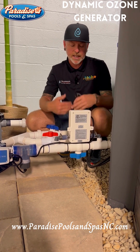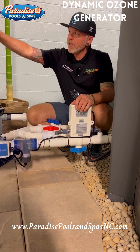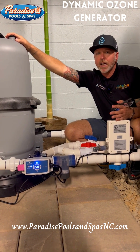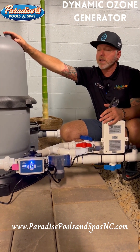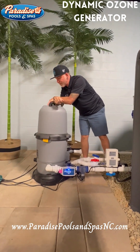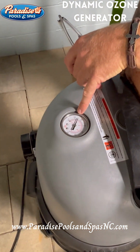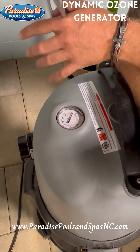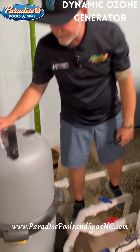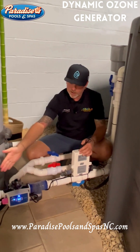The directions are written on the side I'm facing, but I want to make a YouTube video to help everybody out. With a brand new or clean filter — and by clean I mean no scaling inside the filter pleats, because scaling will make it run slower — you should see only 10 to 15 pounds of pressure on top of your filter gauge. I tell people just start with a brand new filter at the beginning of the year so there's no guesswork. Once you confirm that clean filter at 10 to 15 PSI, turn the pump on and let the water start flowing through.